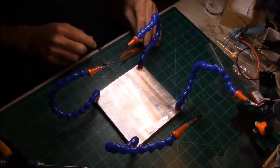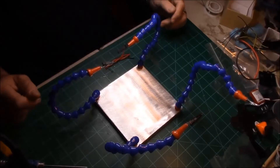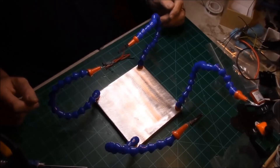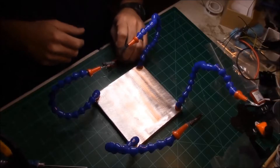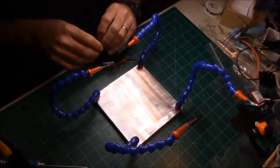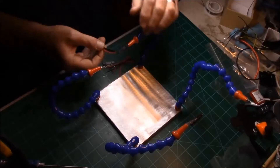What I've done is cut eight wires — four red, four black — cut to about three inches in length. I'm going to tin them up now, then run them to the flight controller coming from the bottom up. It's pretty easy to do and I'll either skip to where I'm done or fast forward.